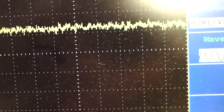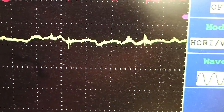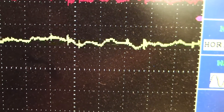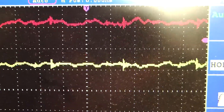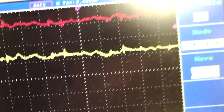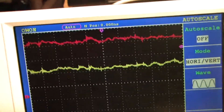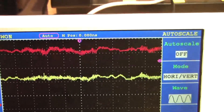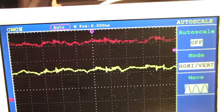Let's expand out the time a little bit. You can see a semblance of a sine wave in there — that's just typical noise from the power supply on both channels. Nothing unusual there — both channels are about the same, which is good. That means they're both functioning equivalently, and that's a positive thing.